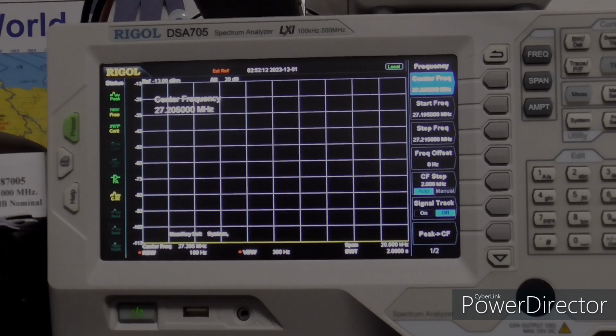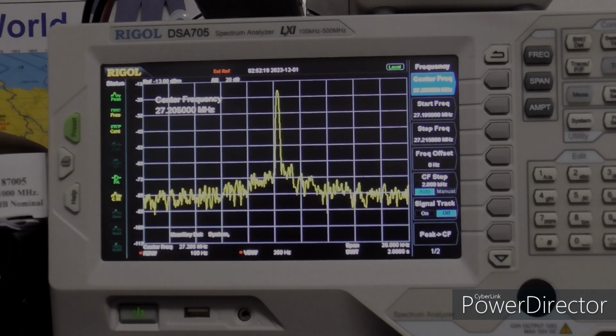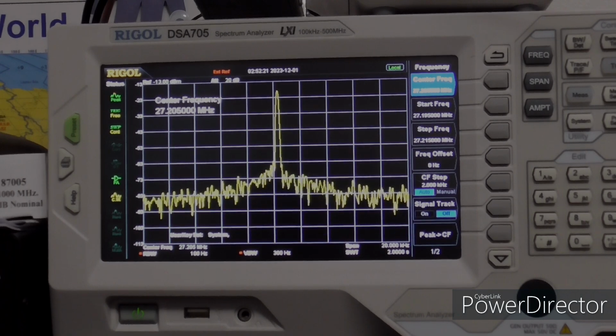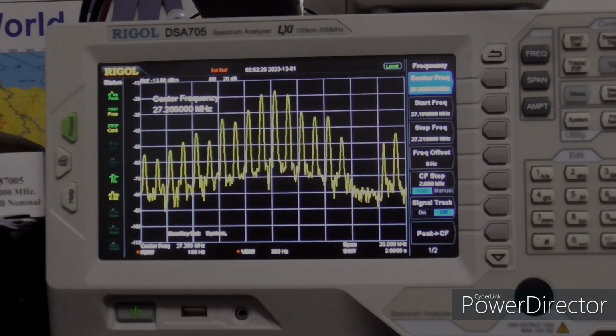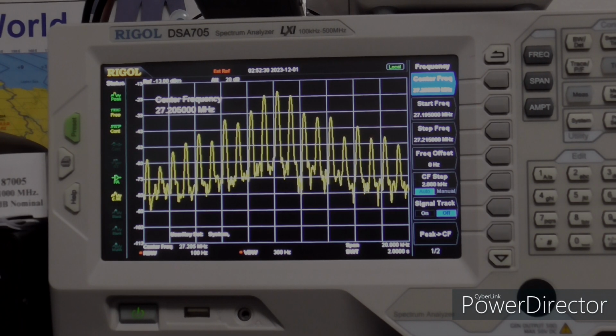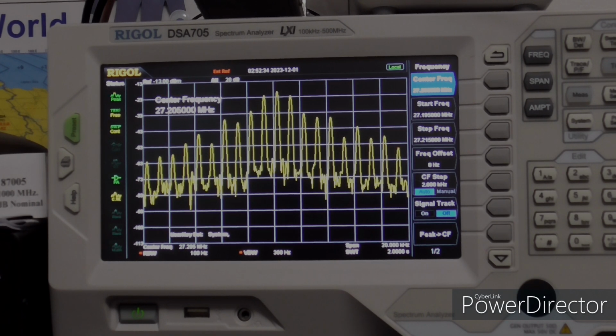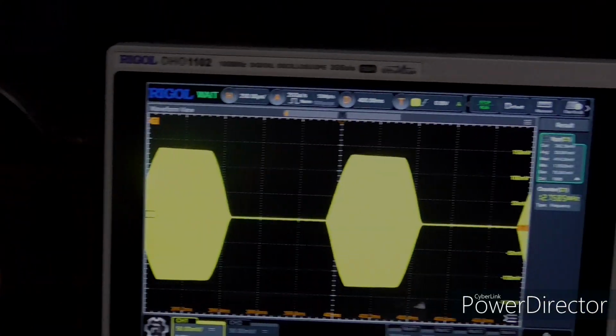Let's put the tone in here and see. Spectrum analyzer is in one channel each direction. Just key it up with the tone. Alright, so that doesn't look very good. Splatter box. Mod scale's pegged. RF power shows 12 on the scale. So there's a scope. It looks terrible.